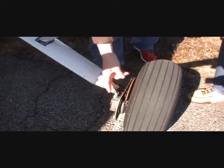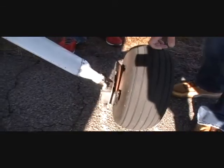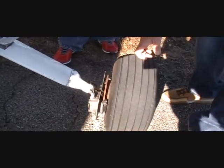First we're gonna check our tire. So we check it for pressure, make sure it's not flat. Check our brake pads, make sure they're not worn too much. Our brake line isn't cracked or leaking any hydraulic fluid. Alright, so all that looks good. Small little rotor. You actually hardly have to brake at all when you stop these things.